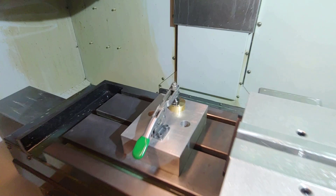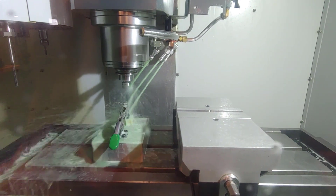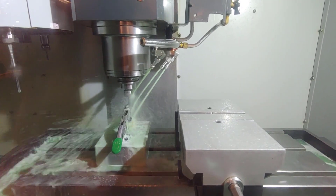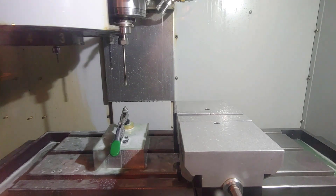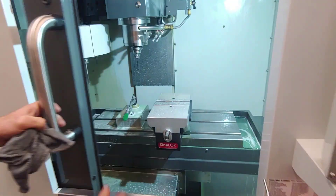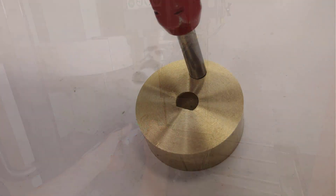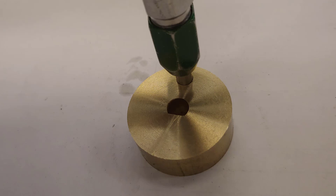Once the part is secure in the fixture, we verify the correct CNC program is loaded and press the green cycle start button. The drill comes in — a C-sized drill — and then we take off a little more material with the reamer. Reamers are only designed to take off a small amount of material, usually less than 10 thou, hence the size of the C-sized drill. We then double check with the go/no-go gauge that the red doesn't fit and the green fits, ensuring we have the tight tolerance of 249 plus 0 minus 3 thou on our crank disc — a unilateral tolerance giving a slightly smaller hole than the dowel pin that will be press fit in.